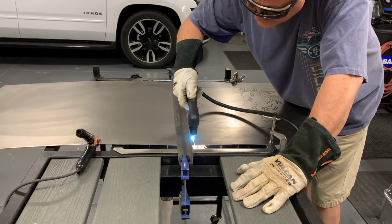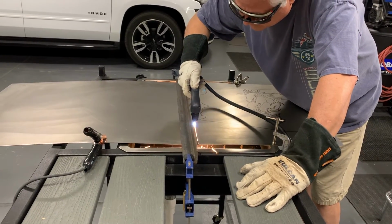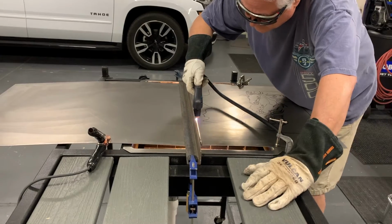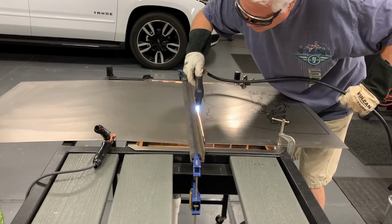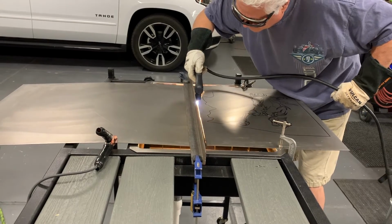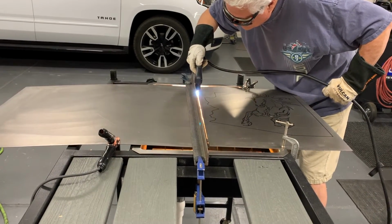An item I forgot to mention is the tabletop surface itself. It's two pieces of Trex, grooved and composited deck board. I cut them to fit, and they free float on 4-inch flat stock, welded at both ends of the table. This allows me to remove the board and clamp steel down when making straight cuts as shown here.